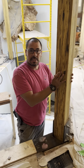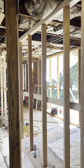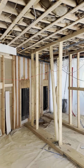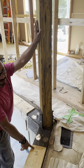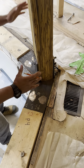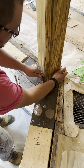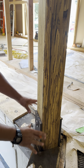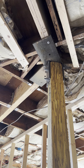We have 15 columns to go in to support the church. And this church, we found out as we did the demolition, is very unique when it was built. But the column here that I'm referring to, we'll call it C5, column 5. And basically, this metal plate and these that support this column is completely separate than what's at the top — the cap plate, what's called the cap plate.